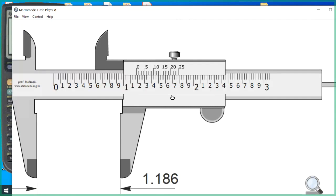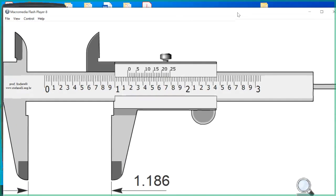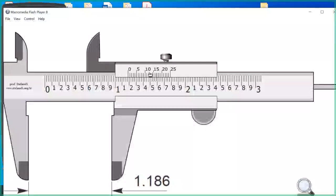Now, I will not make you read vernier calipers in this class. I'm showing you these just to give you a chance to appreciate how much simpler some modern technology has made things. But I wanted you to see that vernier scale and see how it works. It really was a kind of ingenious thing to just make the lines 1/1000th of an inch closer together than the regular lines on the caliper, so that you could read that extra degree of precision there.